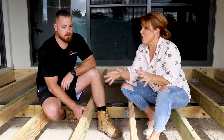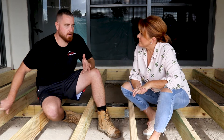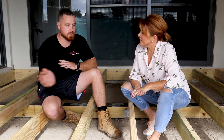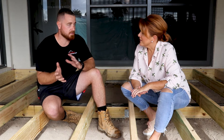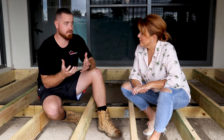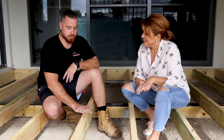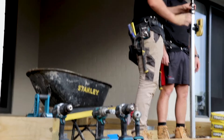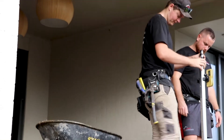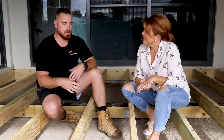The first thing — if you want to keep your old subframe, I would probably look at getting a carpenter or builder in to check if it's sound, strong, and structurally fine to take the weight of the new boards. Trex boards are quite heavy compared to other decking products. You also want to check your joists are level and flush, and there is a good Trex Protect tape you can lay over the top to give the joists longevity and stop the holes filling up with water.